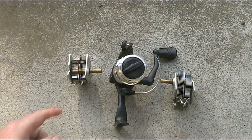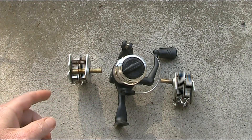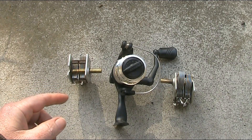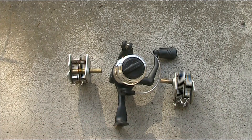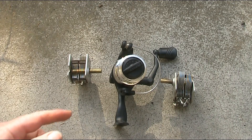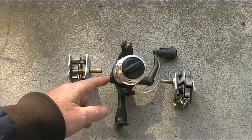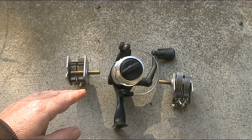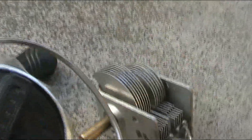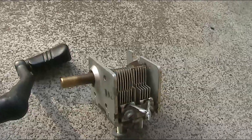There's another case where having one side going anti-clockwise and the other clockwise could be handy. Certain antenna couplers use a differential variable capacitor arrangement, where one capacitor goes up in value as the other goes down. It's not very commonly used these days because it's mechanically awkward, but you could potentially have both controlled by this unit — one variable capacitor on each shaft. When one is near maximum capacitance, the other is near minimum, and when you reverse direction, it's the opposite.